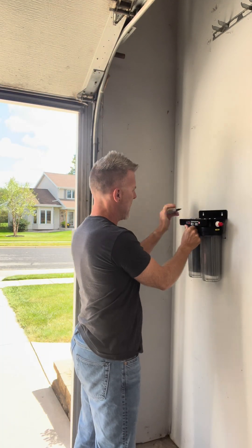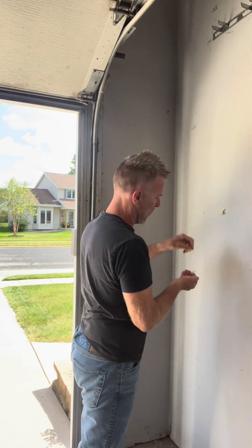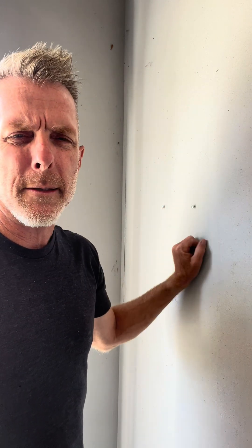I've found a spot in the corner of my garage, convenient to my driveway and to the garden hose where I'll be running water to the unit. I haven't located any studs in the wall, so I'm just going to be using some standard plastic wall anchors with appropriate screws. I want to make sure you find a screw that is small enough to fit through the bottom of the keyhole but the head is large enough where it doesn't come out the top of the keyhole. I'm going to mark the location, drill some holes, put in the wall anchors, and get this unit hung. When putting the screws in, do not run them all the way up to the wall anchor — leave them sticking out about a quarter inch, then hang the unit on those and tighten them up the rest of the way to secure the unit to the wall.